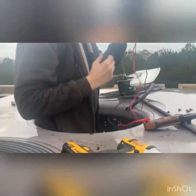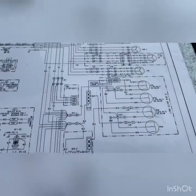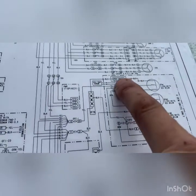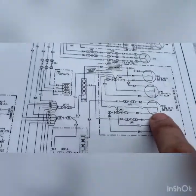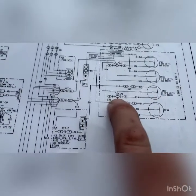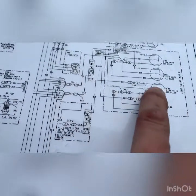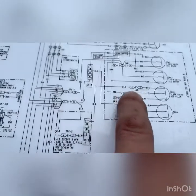So we don't condemn the motor yet — we've got to find why there's no voltage. The rain is back so we're under umbrellas looking at the schematic. These two outdoor fan motors get their power through the speed control — the black comes out to each of those two that are working. This one is the one we're talking about. The yellow and brown with squiggly lines chase back to the capacitor — that's 120 volts, but still one leg. The black is where we don't have voltage. We need to chase this back through a low ambient relay, check for 120 volts there, and if not, check back further to the OFTB — outdoor fan terminal block.